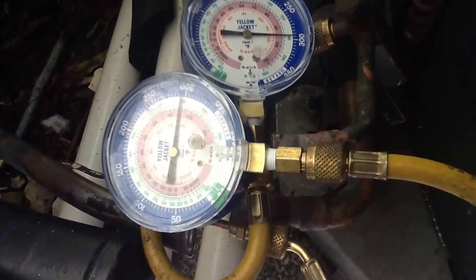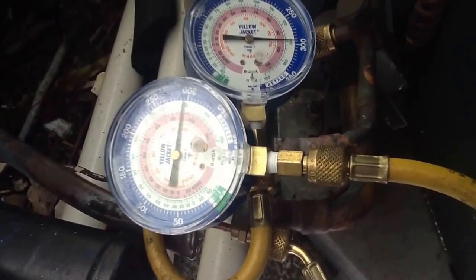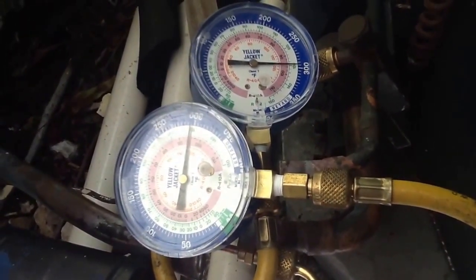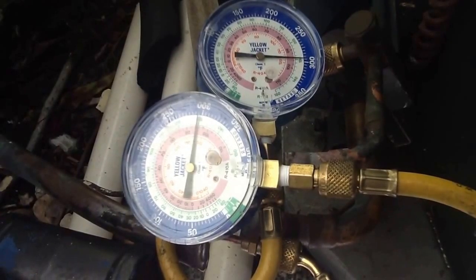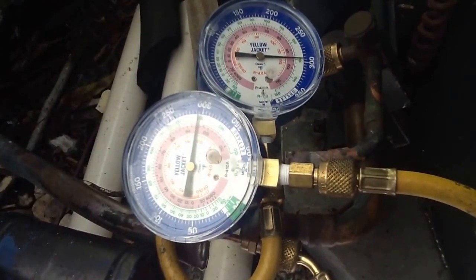Okay folks, I came back to the job yesterday that we had put on a leak search. We filled it up with approximately 300 pounds of nitrogen. When you see this, you're going to say it's less than 300 pounds. When you have a temperature difference - the warmer the temperature, the higher the pressure; the lower the temperature, the lower the pressure.